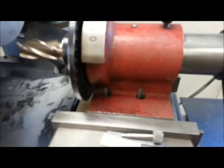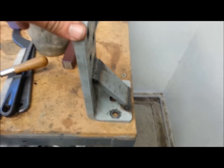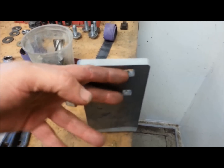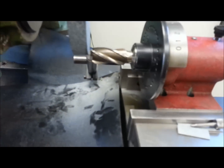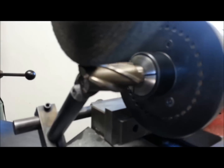With the exception that I've drilled and tapped four holes in the base — I do have another 90-degree angle plate fixture that I bolt it to, to mount it either vertically or horizontally. This plate right here — I bolt this to the table and the spindex fits in on these four holes. I can mount it horizontally or tip it up vertically. It's a pretty cool little thing I can just bolt down to the table. With some playing I can get this dialed in a little better, but I'm really enjoying the way it follows those flutes and makes that grind.